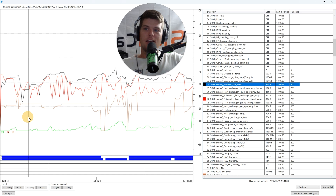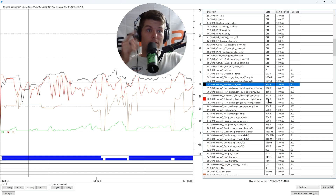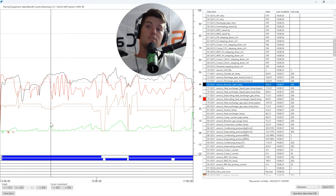Let's jump to where the lines 'flippity-floppity' — yes, that's a scientific term — and go in the opposite direction. The liquid has changed direction. Here we have 69.8° and 80°, a 10-degree difference. The red line coming into the unit reads 88.6°F, and leaving the subcooler going to the outdoor heat exchanger is 69.8°F. This means liquid is flowing from the indoor units to the outdoor unit — that is the direction of flow.